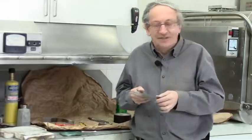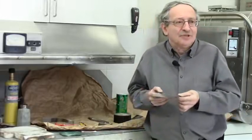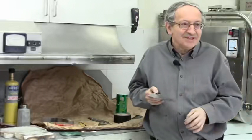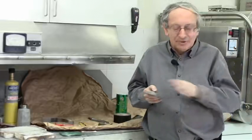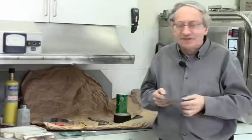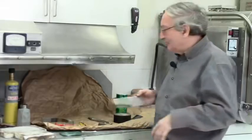If you nickel plate, any operation to do with surface bonding has to be done within 1 hour of activating the surface. Now there's a way to protect the surface, it's called gumming. If you have to clean a lot of parts one day and paint them the next day, there is a solution called gumming solution. You can wash the parts in it and rinse them off next day, and it preserves the surface activation, but it's not for prototypes, you just clean it before use.